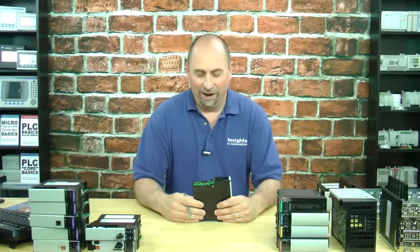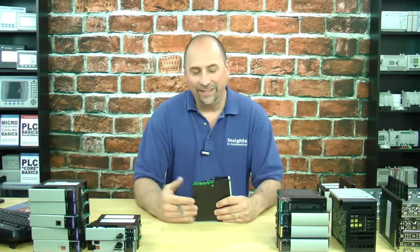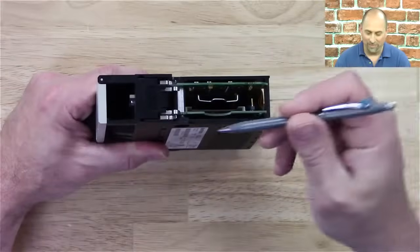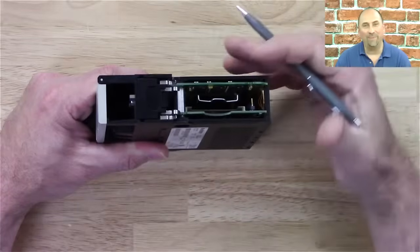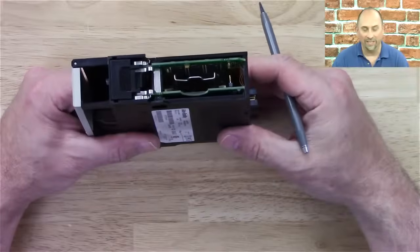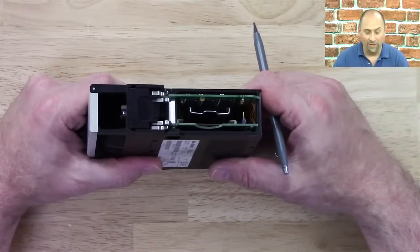That's pretty bad. You have to stop your processor and rip it out just to put a non-volatile memory chip in. I joke with people — they did this with the original PLC-5, and when they came out with a new platform PLC-5, they put it in the front. So that guy who did the original PLC-5 must have needed a job and designed this one, because it's back in the bottom again and it's not easy to get to. I've got to yank the processor to take it out. It was a good feature to have, but a lousy place to put it.